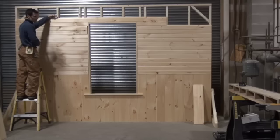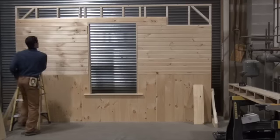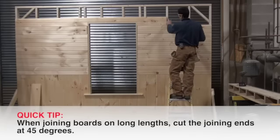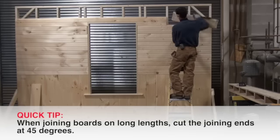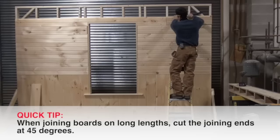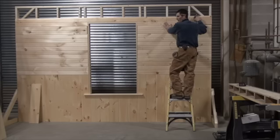I'm using six-penny galvanized finish nails — not too long, because if you go longer the shank would be thicker and would split out your pine. Six-penny galvanized is what you want. On the end of the pine I've 45'd the end, and you want to land it in the middle of the stud. The next piece I've also 45'd to cover the joint, so when it separates during dry months you still have wood behind it and no gap. If pine dries that way and never goes back, you can use natural pine filler.